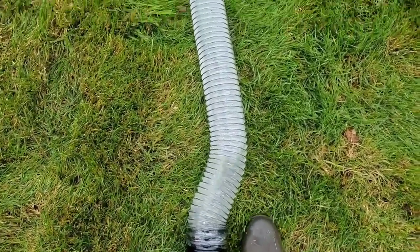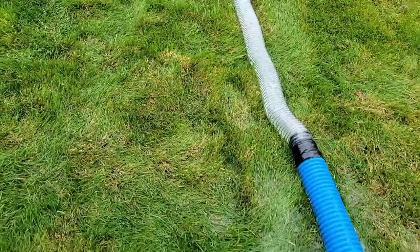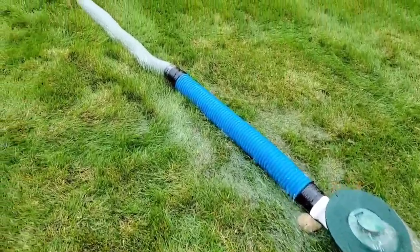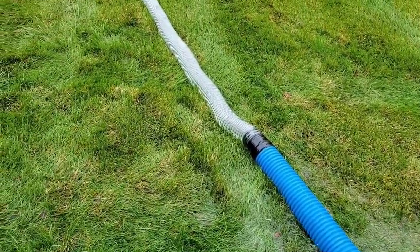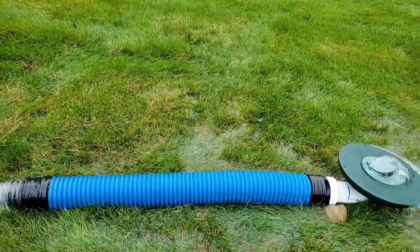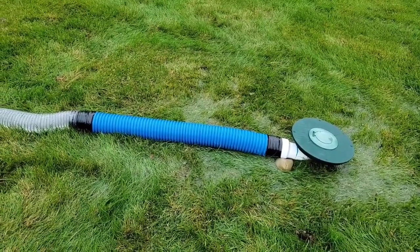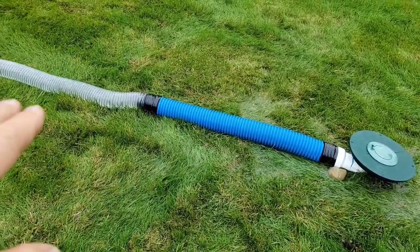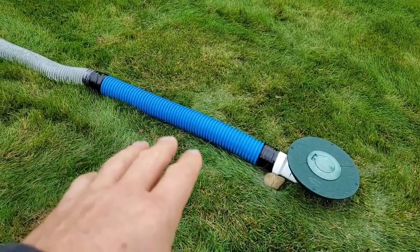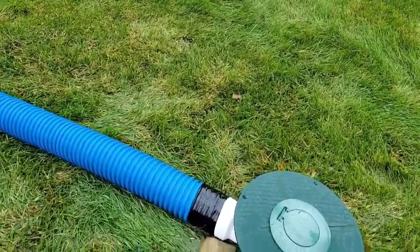These are very detailed and technical demonstrations we put together for you. We've loaded the whole pipe up with water — really good flow. Now we're cutting the flow of water to show you what happens. See how the water is just sweating out of the knife cut? When the rain event is over and the water finishes running off the roof, out of the gutters and downspouts, the final bit of water comes out of the pop-up. You can see it leaches right out of the knife cut, so the pipe won't hold any water.